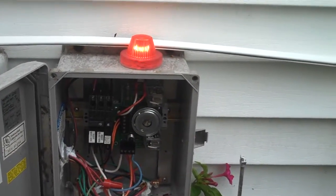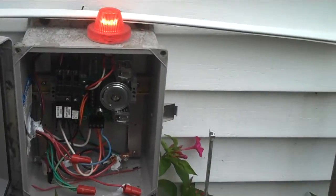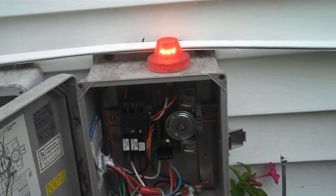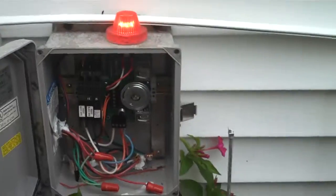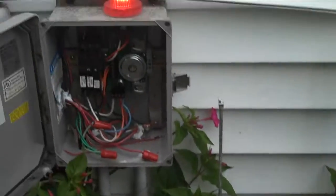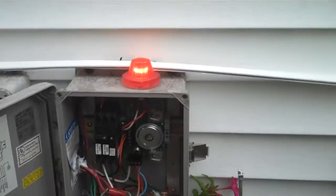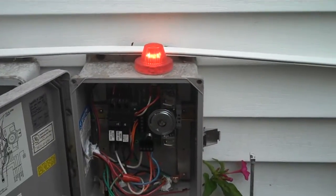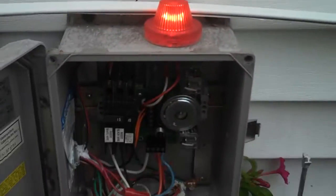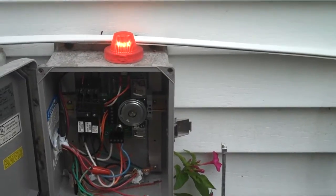We're going to have to report a failed alarm on this system, because that's exactly what we don't want to happen. If you did have a failure of the pump and the alarm went on but then burned out, you'd be very unlikely to hear it — that alarm did not sound terribly loud to me, and when this door is closed it's going to be even harder to hear. This is going to require further investigation in terms of what exactly is wrong with the alarm, but hopefully the red light will go off, which will tell us the pump is working. What we were really trying to test here is the alarm switch inside the pump — that's the sensitive part that can break — but we're also testing all of the other components in the alarm system.